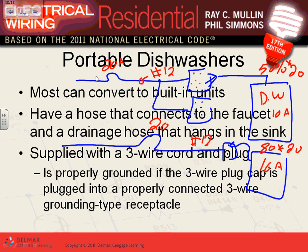This rule applies to any portable equipment that you plug in. You're not supposed to plug a portable appliance into a convenient receptacle shared with other lights and receptacles if it's more than 50% of the circuit's capacity. How do you enforce this in practice is a different story.